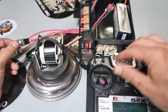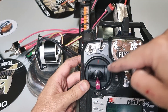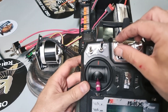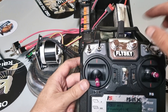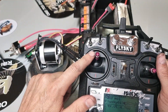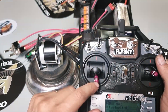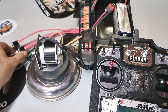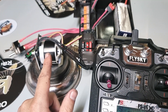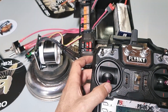Now that we've set everything up, let's calibrate the throttle range. Put this into the zero position because now that we've got reverse, we've got two zero points. Keep in mind your speed controller won't boot if it's sitting somewhere in the throttle range — it must be at zero. Put the stick into the top position to calibrate throttle range, you'll hear a beep beep, then move it down and it calibrates that range. It'll initialize the four cells and the system will boot. Throttle range is calibrated — forward and reverse are now active.